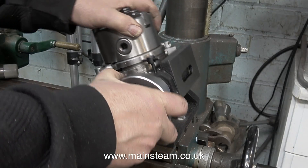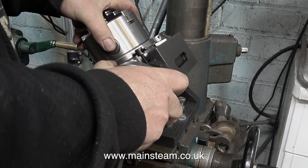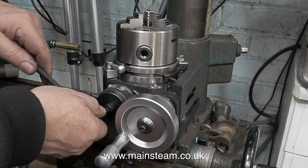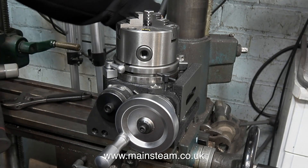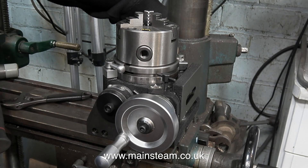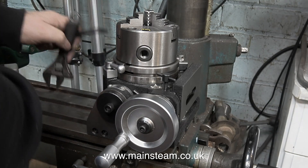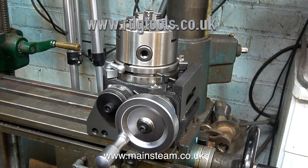Here I'm seeing how firm the unit is when it's been swivelled, and it's very firm indeed. I'm quite pleased with this. Do bear in mind this is not industry — this is my model engineering workshop. Like other things in my workshop which are not top quality, the milling machine itself is an old Korean thing, but it's accurate. In this video I'm just showing you how I modified the mounting of the rotary table. I will show the final accurate setup using the dial test indicator and how it works in a future video. But before I do that, I'm going to make some new T-nuts because I don't like these. So that's about it for this video — thanks for watching and I hope you found it useful. See you next time.